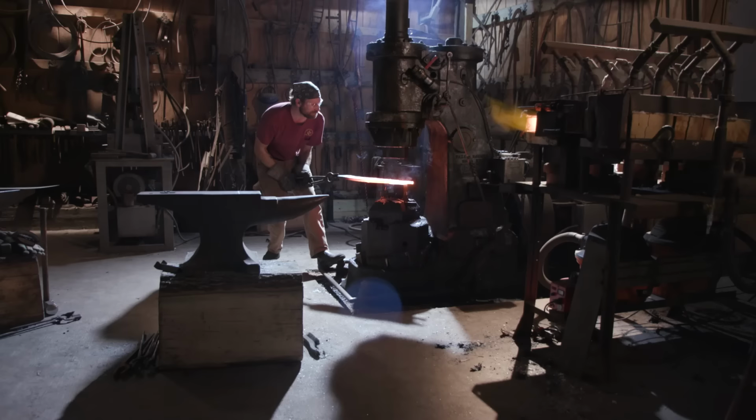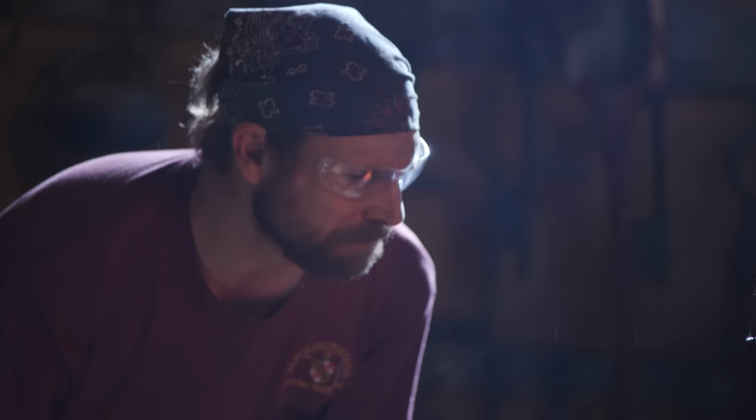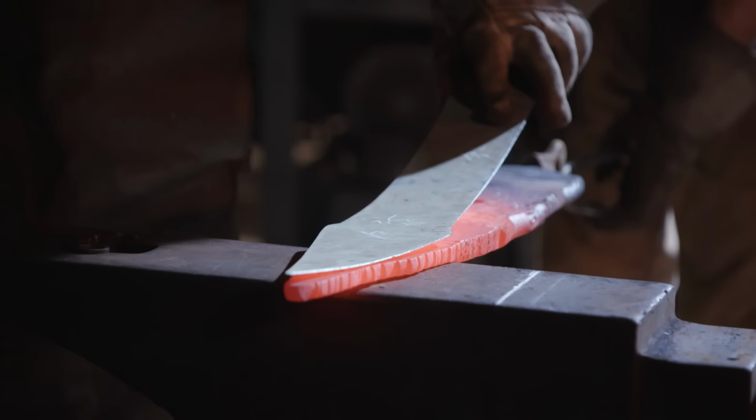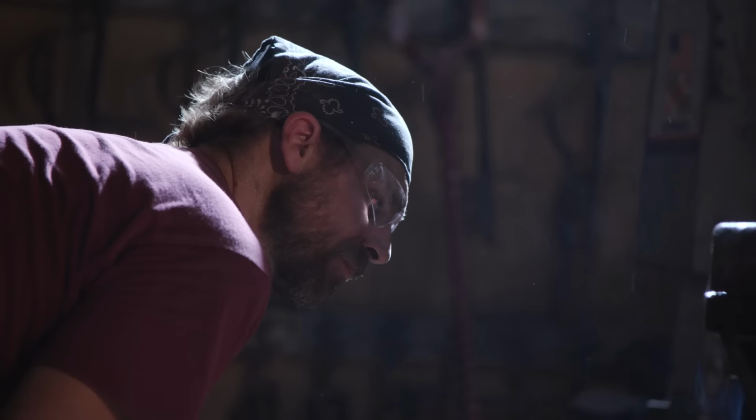As you know, we've got a CNC plasma table. So when we're trying to figure out the sizing on weapons like this, even if we're going to forge them, which is nice to do because we have a big power hammer and it's nice to forge that blade out, we tend to cut a pattern. You could cut it out in paper if you were set up that way, but since we're already set up in the CNC setup, we're going to go ahead and cut out a template. Derek will use that to check against the shape as he's doing the forging.